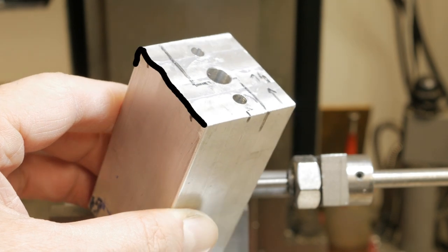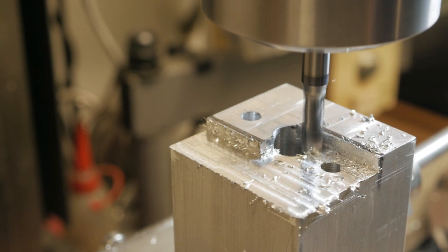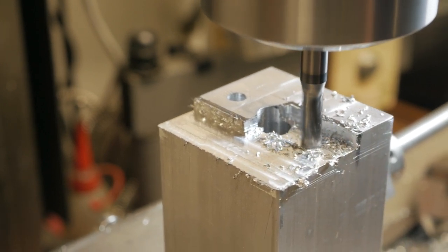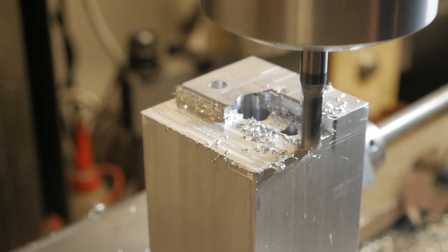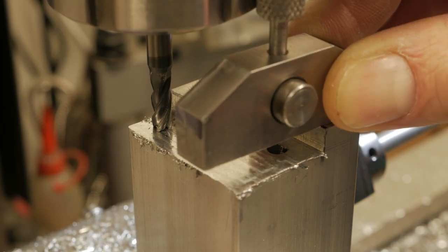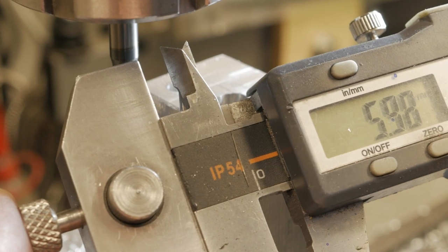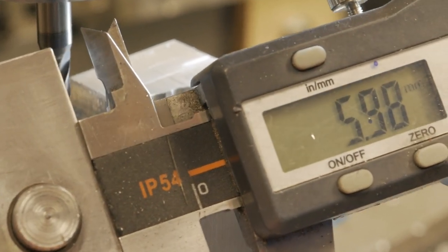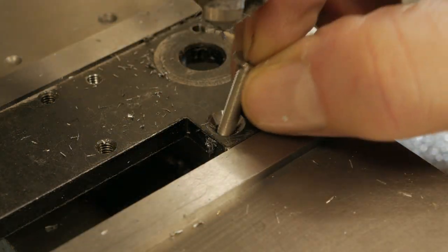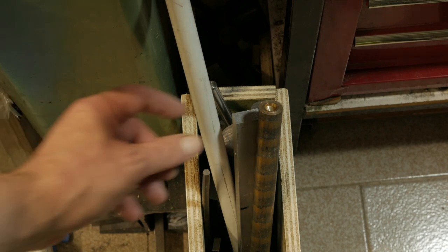On the head of the aluminium block, I obtain the negative of the steel plate, so that the aluminium block rests on the plate, increasing the resistance. The block rests on the plate that fixes my drop dispenser, therefore there are four screws that resist in rotation, two for the aluminium block and two for the steel plate.